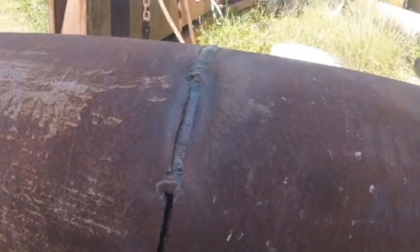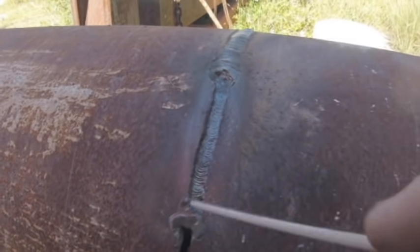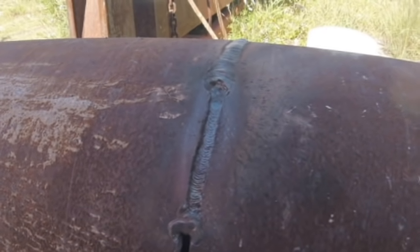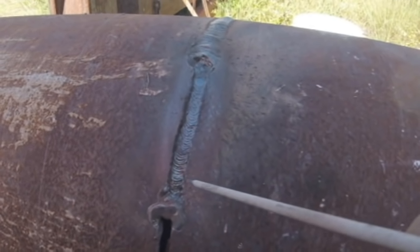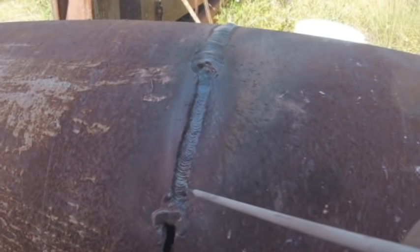Deal with a heck of a high-low. I'm trying to do this without any grinders and trying to do the best job possible so that you can see that it is possible. So basically what I'm going to end up doing here, my weld pattern is going to be somewhat of a J. I'm going to run up this side to create a buildup on this side and then roll onto here and pause.